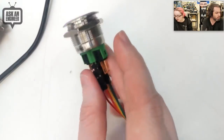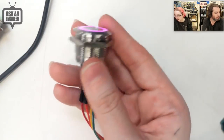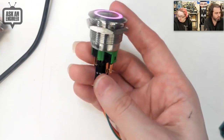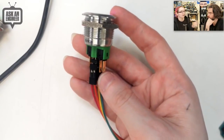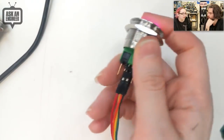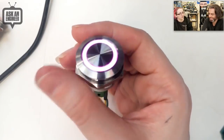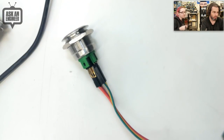The larger button is slightly stouter as well. Measurements are in the tutorial page. It comes with a mounting screw and four contacts on the bottom for RGB — both are common anode. This larger one has two SPST switches: one normally closed and one normally open, completely separate. So you get extra switches — useful if you want to control two different things, or have one turn off and one turn on at the same time. Mostly it's about the RGB, but stay for the clicky! We have four types total: two sizes, two styles each.